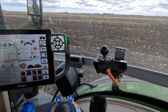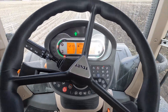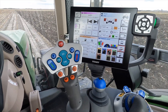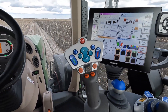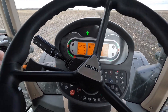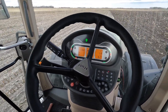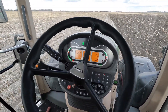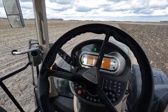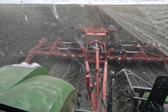I had been running the RPMs manually at around 1450 because it seems like if you use TMS with tillage, when you pick up at the end it throttles down, and when you put the implement back in the ground it doesn't react quite fast enough and it really bogs down the engine. I'm not a big fan of that for tillage, so I like to run it at partial RPMs and let the tractor do the rest from there - it's not quite reactive enough for tillage work.